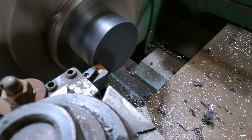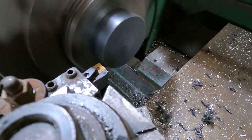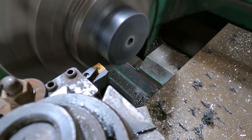We've cut a few chunks from our plastic on the bandsaw, and here we're just cleaning up the faces, then center drilling and punching our three-quarter inch hole straight through these pieces. I'm only showing one since it's just a wash-rinse-repeat operation.